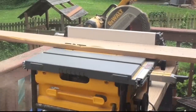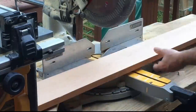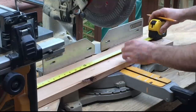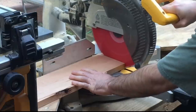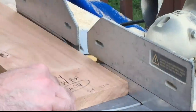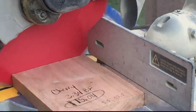The first step is cutting all of our boards down to five and a quarter or six inches in width. Then for all of our top and bottom pieces we'll cut them all to their finished lengths with a straight miter cut — that's a total of two large pieces for the top and four small pieces for the returns. Here I'm marking for the final cut on my top and bottom pieces: 51 and 7/8ths plus six inches for the dimensions of the returns, for an overall length of 57 and 7/8ths. Here I'm cutting up my three-inch by five and a quarter inch return pieces — I need four of those and I'm setting up to cut two at a time, matched top and bottom, to ensure they're exactly the same length.